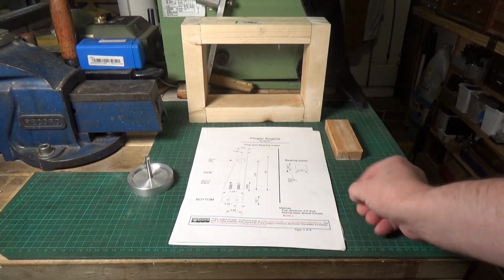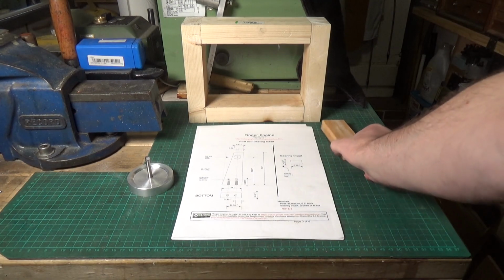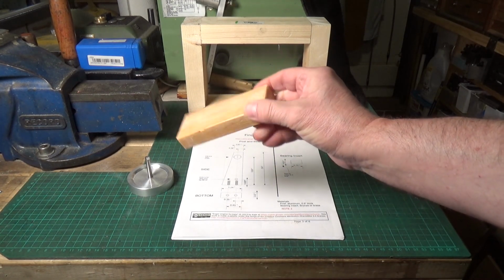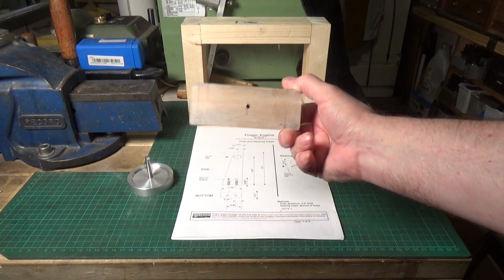Okay, so we're making this piece, or we're trying to. So what am I going to do? Well, I do have plenty of scrap aluminium and I do have a furnace now. So I have made a pattern. It's got pattern draft on all the sides. This is considerably bigger than what I actually need, so that allows for plenty of shrinkage.